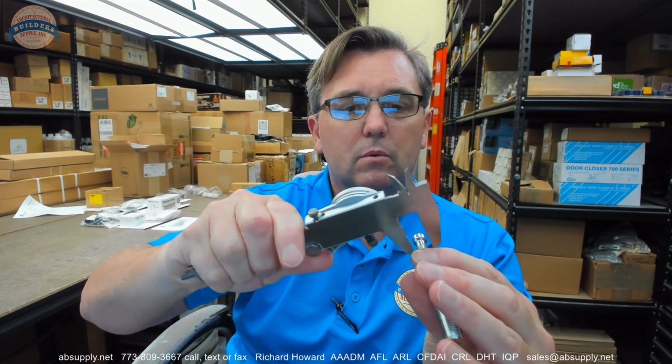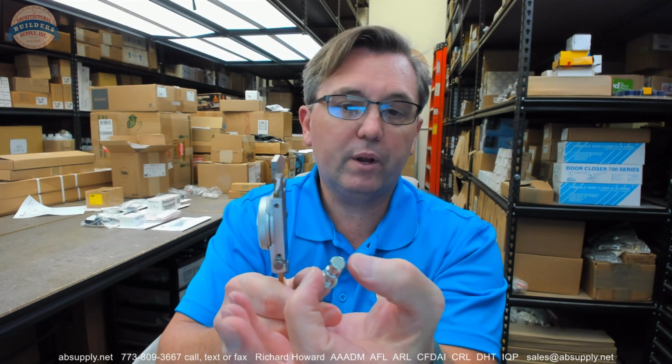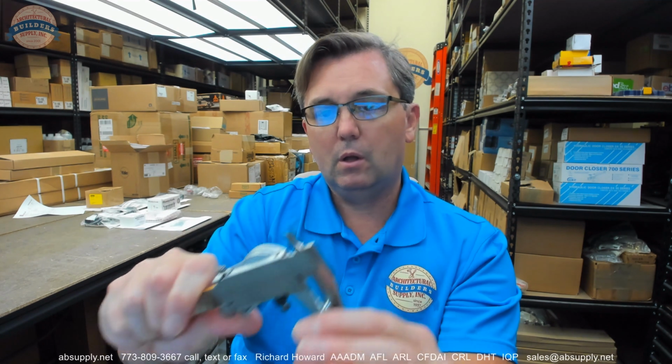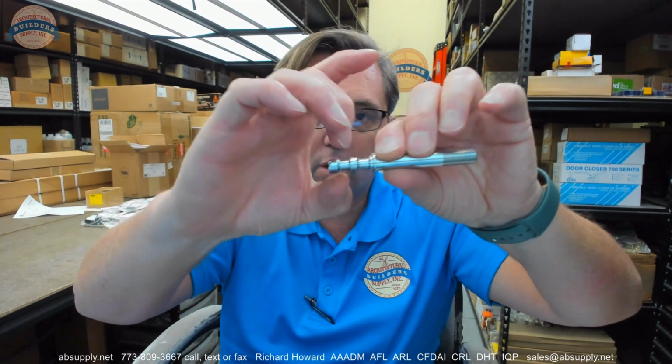So then a couple other dimensions on those double cones. The outside dimension of the cone head, 0.363 diameter here. The smaller diameter, 0.251 smaller diameter right here. So let's switch to the screen view and take a closer look at the service and parts manual and see if we can get a little better idea where this might be used.